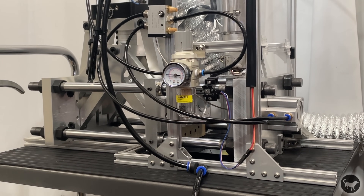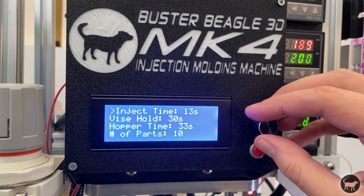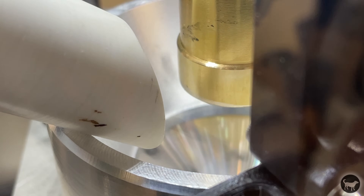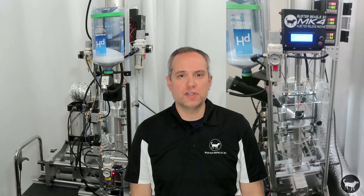The cycle pause time is the amount of time to wait after the mold is open before beginning the next part. There is also a manual run injection option: it manually turns on the plunger for however long you push down the rotary button, automatically records that time, and sets your injection time to it — this is the way to test and set injection time. Similarly, manual run hopper runs the pellet feeder motor so you can see how long it takes to refill the chamber, and that time is also recorded and set in the hopper time. After that is the start button. The Arduino remembers your settings for next time by writing them to its memory.